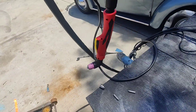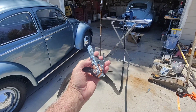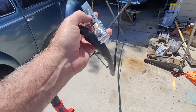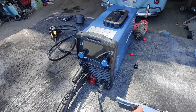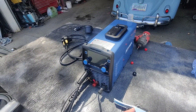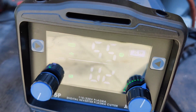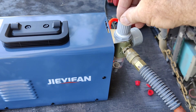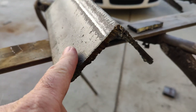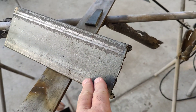The ground cable is about 10 feet and the cutting torch portion is probably 12 feet, so it's pretty long — and it comes with that already. It has a really nice easy-to-read display with a lot of features. The link in the description — this thing is dirt cheap right now, I think it's less than 200 bucks. I've got it set at 55 amps and 100 pounds of air pressure. To set the regulator, you push it down and then twist it.